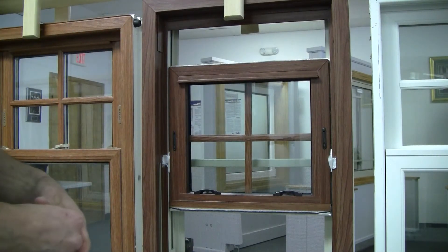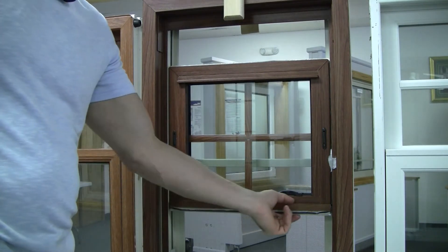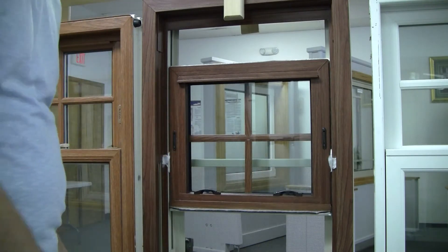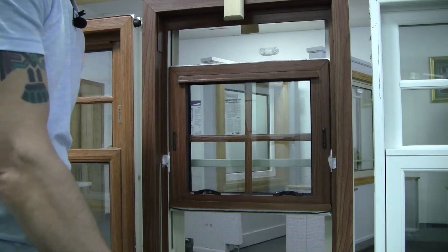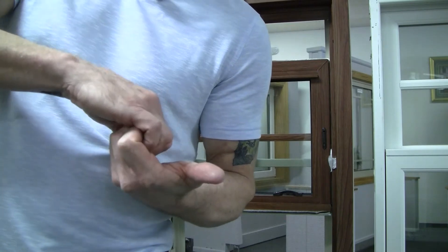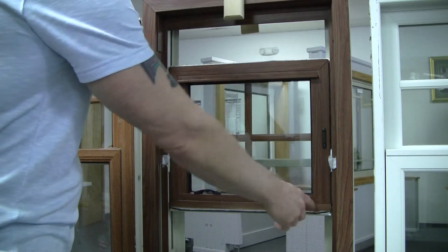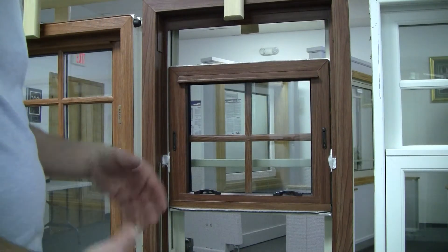This window has a very deep interlock — three-quarters of an inch. And you have the same thing going on where the back side of the sash is. So when those windows are shut, it's a very deep interlock. The other thing is, this is not an add-on piece — it is integrated into the window. In other words, there are no screws holding it on.